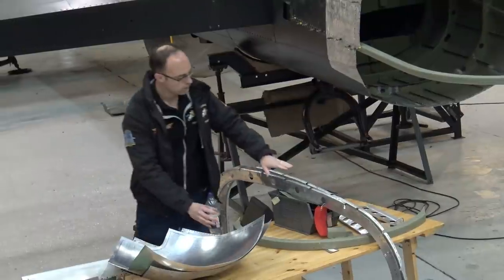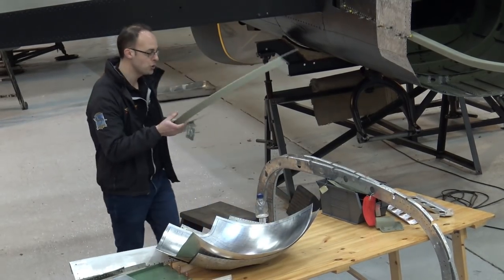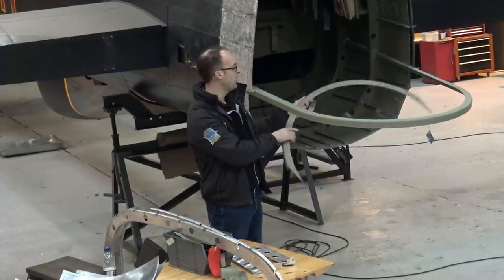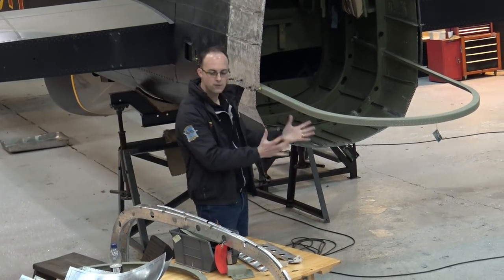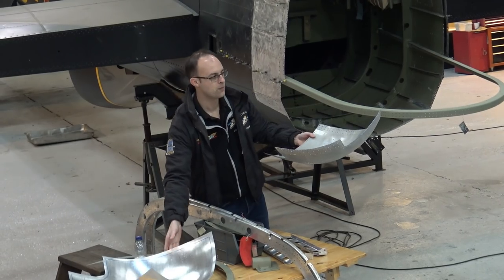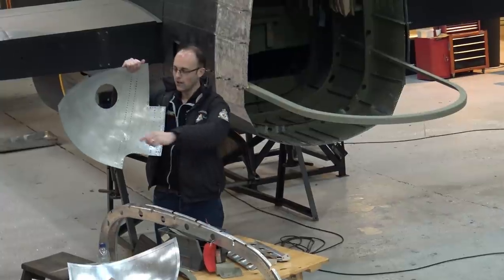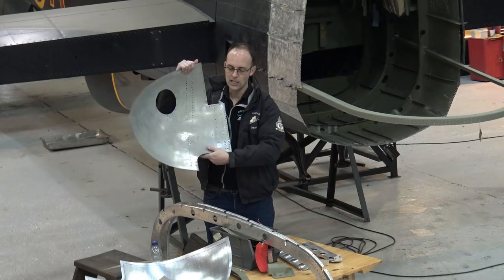From the rear former, going right back to the back of the extrusion here — it's a very, very light structure, but very thick skin. This is the rear part of the hoop that the turret sits in, and it's braced back to the bulkhead by some steel tubes. The main strength for the rest of this structure is made up by thick skins. These skins form the shape of the bottom of this section, and they're held together by a thin strip of aluminium with a little kick in it, which gives a little bit of extra strength.